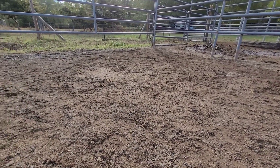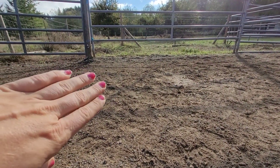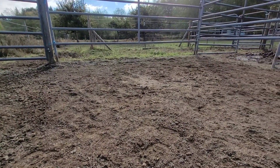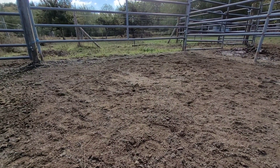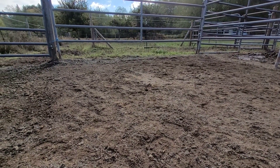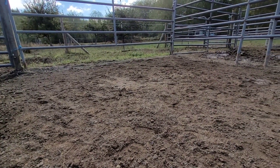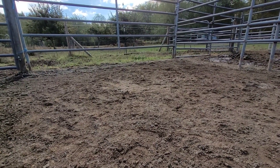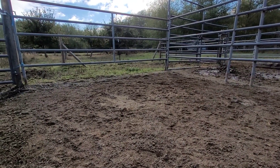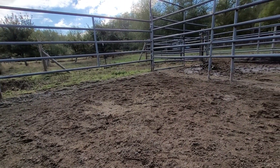In the winter, in the heavy rains, this area holds water. You might be able to tell that down at the far end it banks up, and then banks out towards the field. When I put this in, I didn't really take into account water draining off of it — I kept thinking water was just going to drain through the grid. For me, that has not been the case. It really doesn't drain water through it, and once I learned that, my success with it changed, and how I've gone about new installs. I now think of grading it on a slope that will allow water to come off of it.